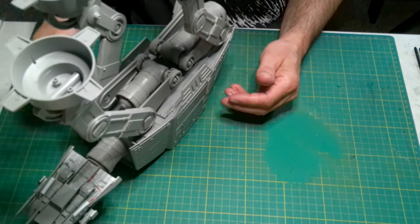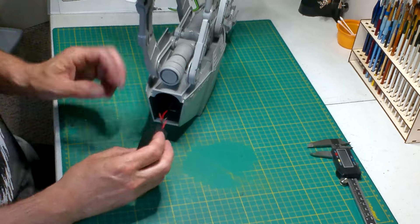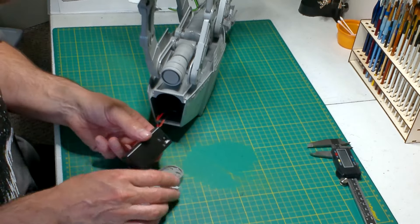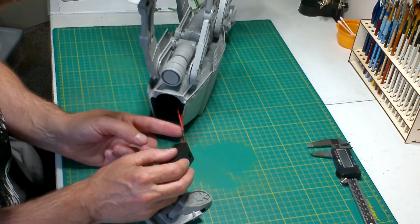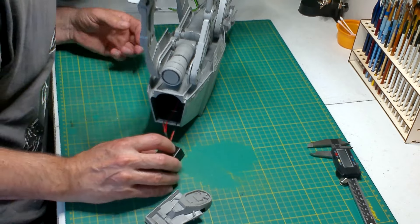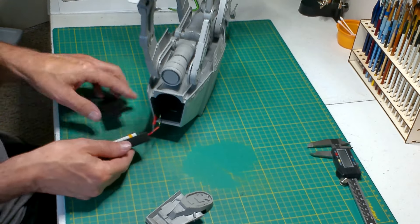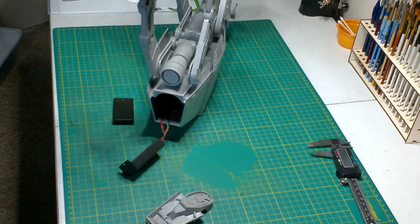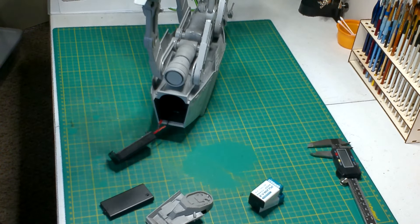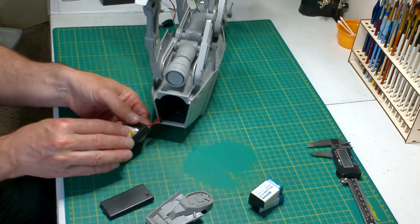I ran the negative back down through, and grabbing the battery case, I joined them here with the other wires going to the red light in the head. I just tied those two reds together and tied those two negatives together to the battery pack. The battery's low because I was running it last night - let me find another battery. One of the regular batteries would probably have a charge left.